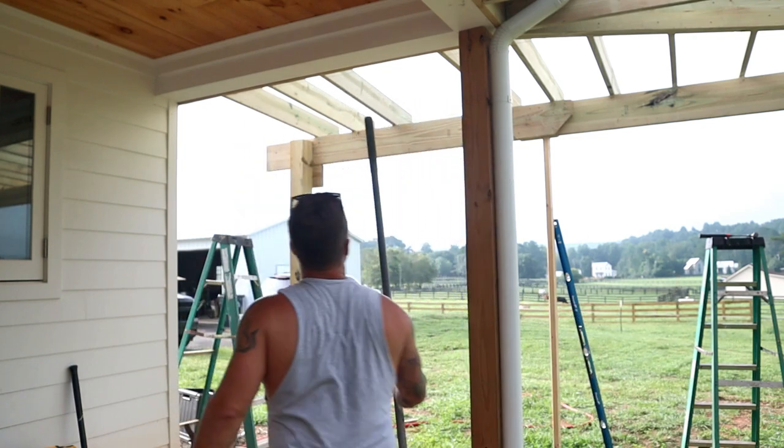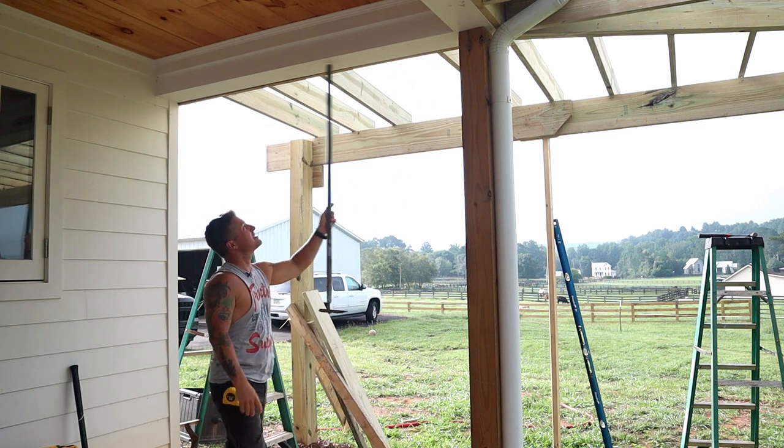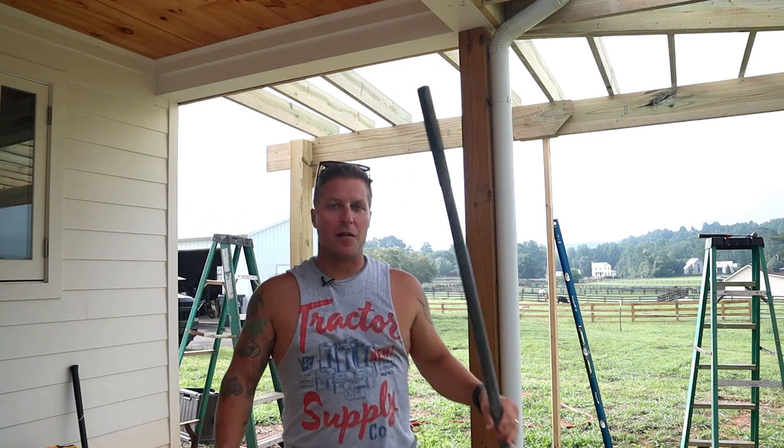And I just realized where I screwed up. Remember the pitch angle that was messed up on these side rafters right here, and it was much higher pitch than I had planned for everything else. I realized what happened. Right here where I attached the ledger board on this porch, my critical error was not checking that for level before I started.